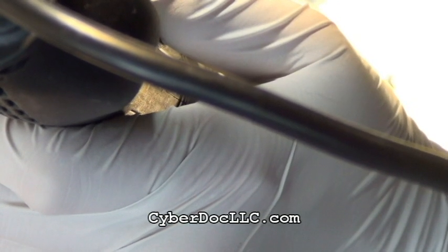So don't go that high. Hence, it comes back to the importance of the lower melting solder we use in this video. I honestly don't know how to do rework anymore without low melting solder. I probably wouldn't want to do this repair if all I had is a hot air gun and soldering iron.